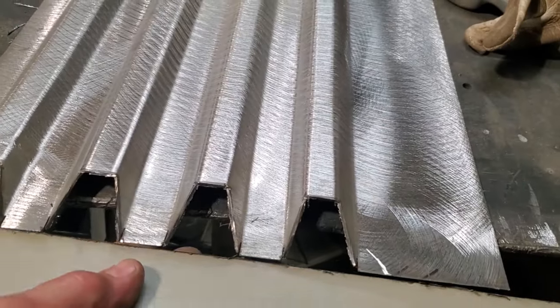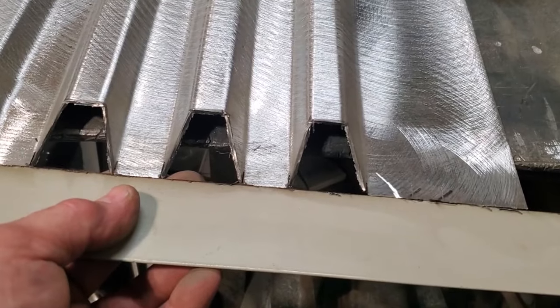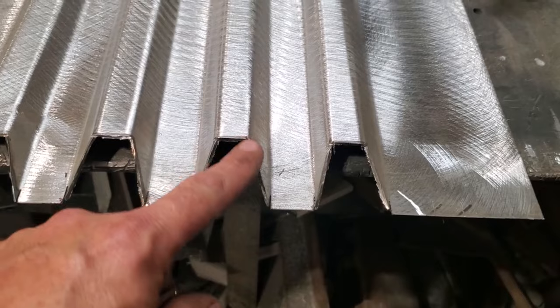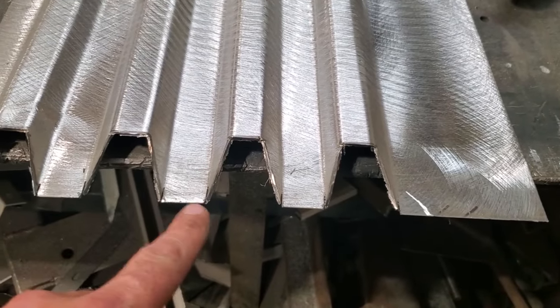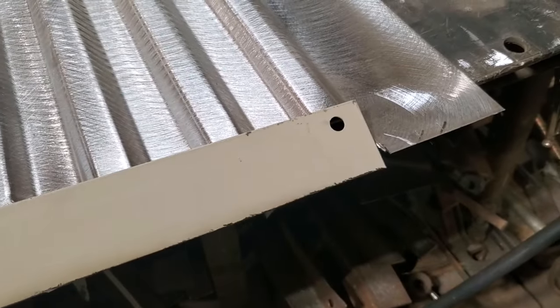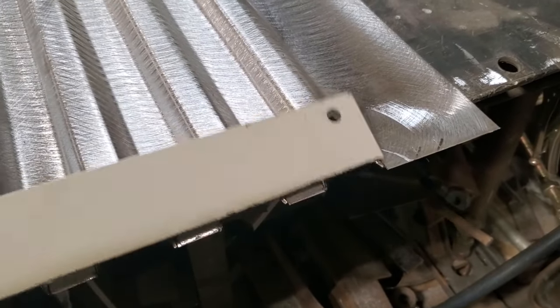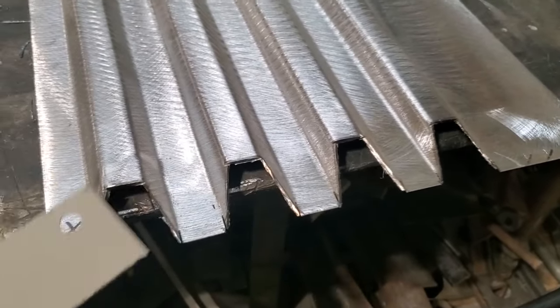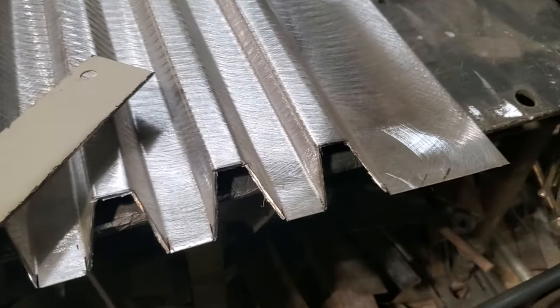I'm going to weld the lip onto that there and dress it all up, grind it all up. But I'm going to cap these ends and bring it down so they're all level here. And I'm using this piece here. I'm going to cut out little pieces now that'll fit in there, mark them. And then I'll go ahead and fit them in there and weld them in, grind them and dress them, finish them off like I've always said before, do one at a time.